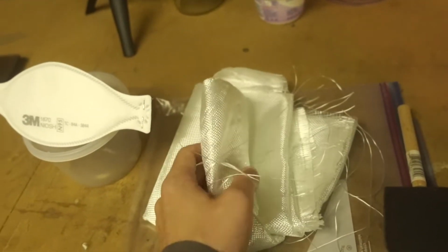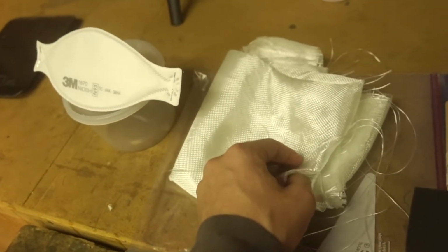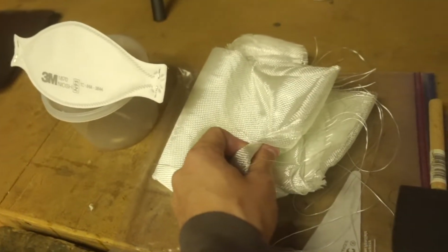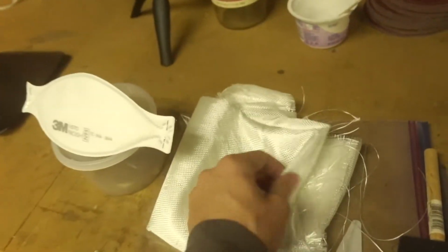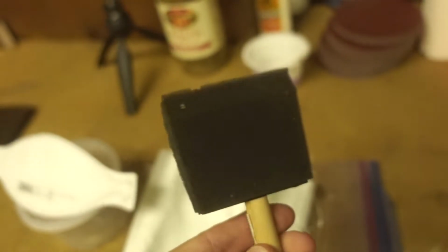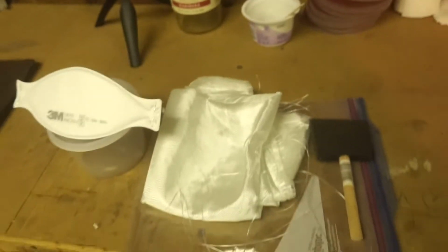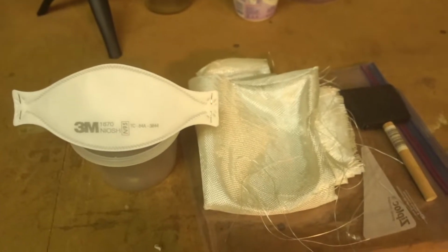This is generic Bondo fiberglass, the same type that comes with fiberglass resin when you buy Bondo brand and work with cars. I think it's fine for what I'm doing, but when I get more proper, I'll know what ounce I'm buying. And then you got a brush like this. You can use any old brush. This type of brush is good when you're brushing on the laminating resin. So those are 3 other things that I forgot to mention, and now we're back to the other part of the video. This is a quick look at the barn situation we got going on here in my workshop.